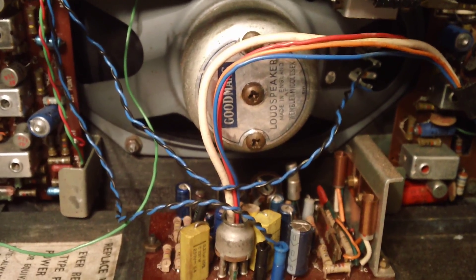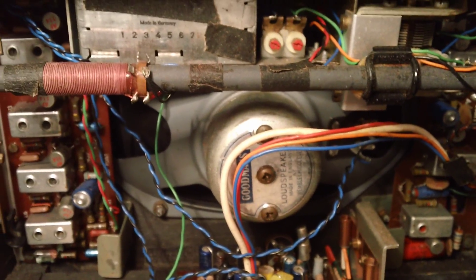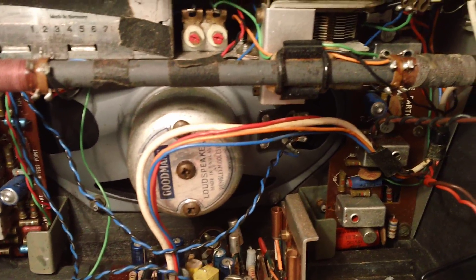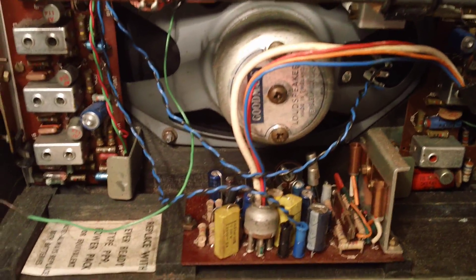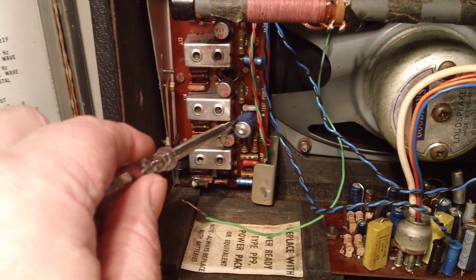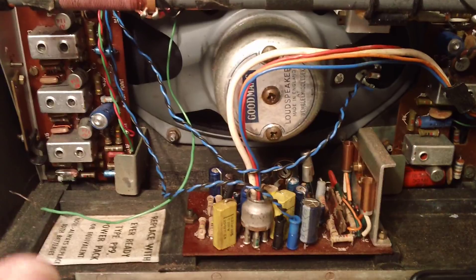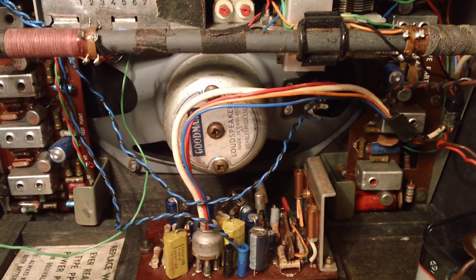This set is going to be rarer and rarer as the years go by - it's 52 years old. I would not normally bother with a transistor radio, but I would like to make this as original as possible. So I'll try and disguise any modern caps that go in there. I could even re-stuff the capacitors really - that's probably an idiotic thing to do, but this one is probably a little bit rarer than the average Sovereign, so I think I'd like to do that.